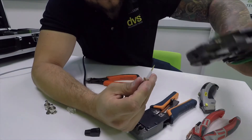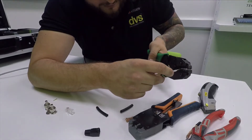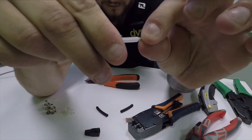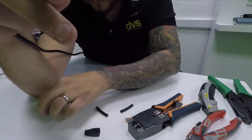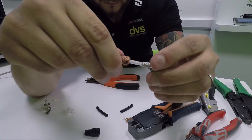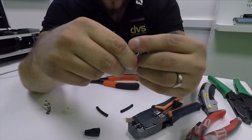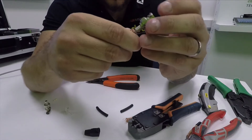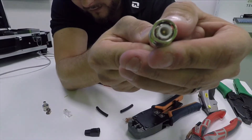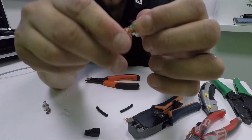You can see that's nice and crimped — give it a little tug to make sure it's secure, that's a nice connection. Then you get your metal outer jacket crimp, slide that over, and if it's bent just straighten it slightly. Slide it over there and push until it clicks in like that. You can see on the end there the metal — push all the way up. Push the metal braid around and twist it just to make it nice and compact.